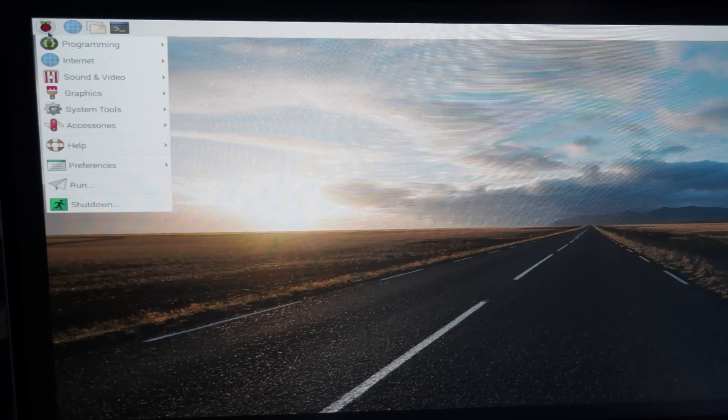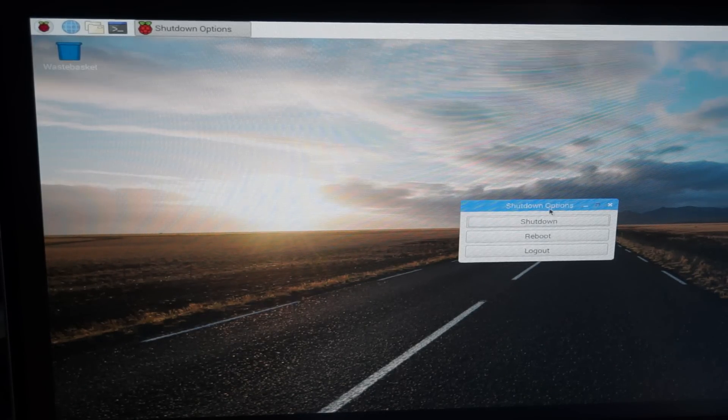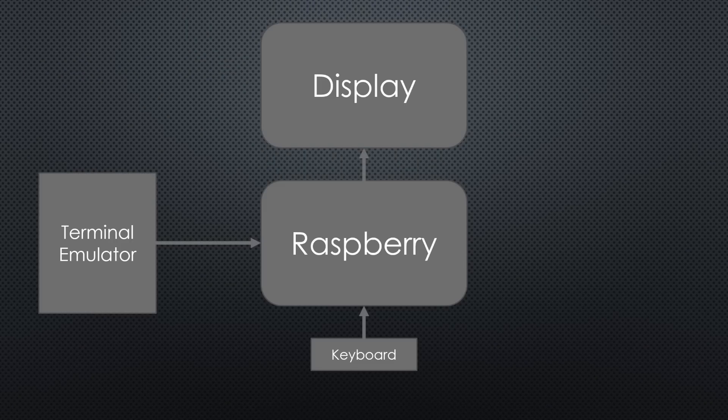This would not be stuff for a video. When we use our raspberries with a display and a keyboard attached, we easily can invoke sudo shutdown now, and everything is okay. In a so-called headless configuration, where we have no display or keyboard connected, this is not possible, especially if we are also not connected through SSH. In these situations, the raspberry has no head which can give the command for a shutdown.